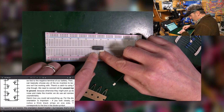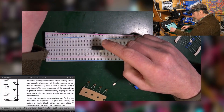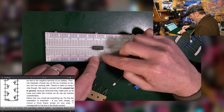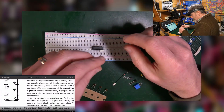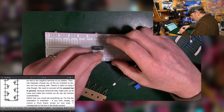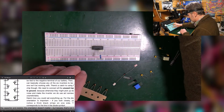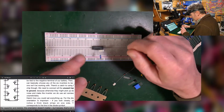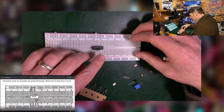So because it's going up to pin 5, that is the back of that Schmitt trigger. And this other leg is going to ground on pin 7. Right, so the resistor also needs to connect to the capacitor, and therefore the back of the Schmitt trigger. And it needs to go, come back, where are you? Here you are. And it's going to the positive.